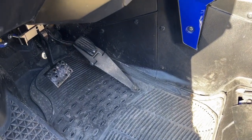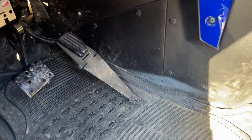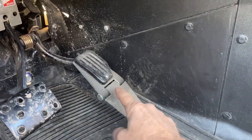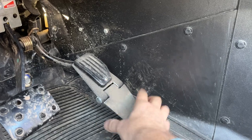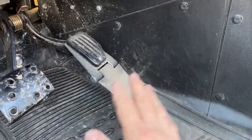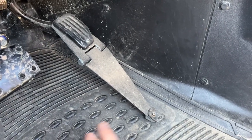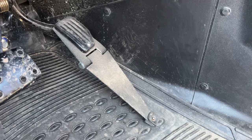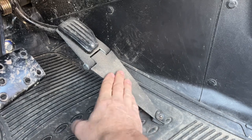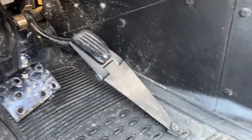I was watching YouTube and there was a farmer on there — I can't take credit for this. He took a hinge, cut a slot in it, slid it underneath, and put a little nut in there so it holds steady. That cured the vibration problem going up a hill. I fine-tuned it by putting some equipment tread on it for grip, and put material on the bottom so it doesn't get caught in the grooves of the mat.